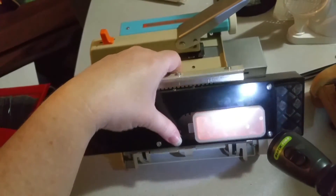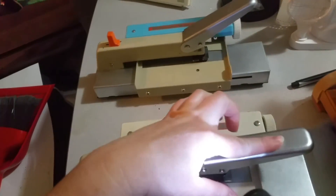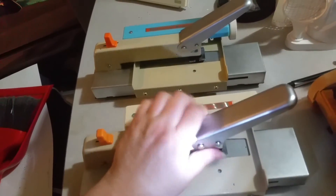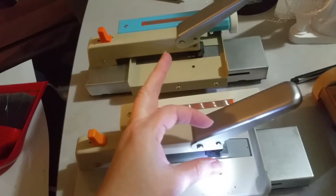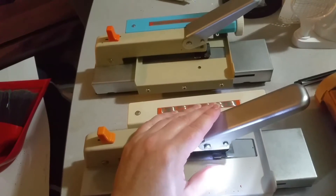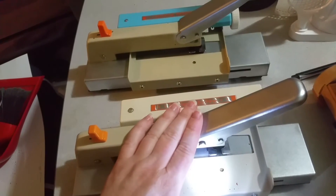When I first got it, the PM10F was stuttering — you could press down and it wouldn't come all the way back up. All I did was adjust the die, which moves it around in orientation just minutely. You won't actually see it move, but it moves it just enough that the punch is able to go through it very, very easily.